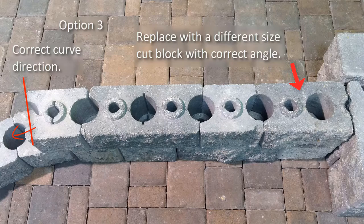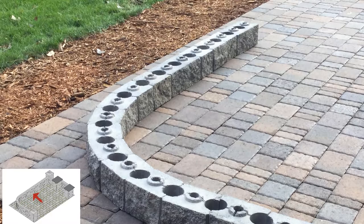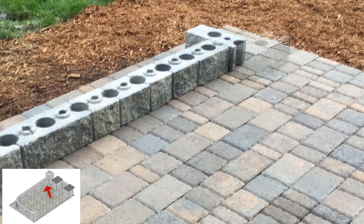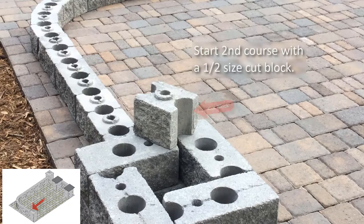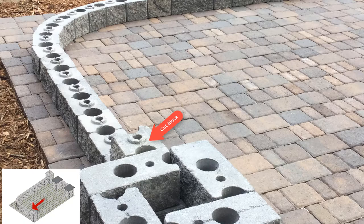Once the angle is corrected, install AB York blocks to build the curve. At the end of the curve, place an AB York block with the long side facing in to create the start of the straight section. Continue building with AB York and AB Dublin blocks to the end of the wall section. Place a three-quarter size cut AB Dublin with the cut side facing out. Place four corner blocks with their long sides facing out to build the next post, so that the wall panel will be centered on the finished post. Install the next course of corner blocks so that they overlap the blocks below. To start the second course, cut another AB Dublin block in half. This will ensure the blocks line up properly and the seams are offset from the course below. Place the cut side against the corner block to create the finished look against the post.